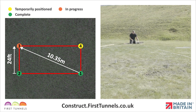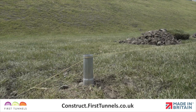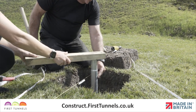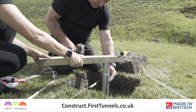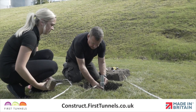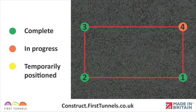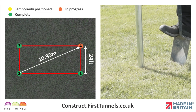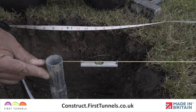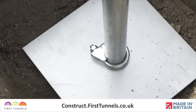If using anchor plates or concrete, excavate a hole and reposition the third corner foundation using the methods described earlier. To ensure the foundation tube is set level across the 24 foot width, tie a string line onto the second foundation tube close to the top. Adjust the height of the foundation tube to the correct level across the width. You may be required to return back some of the hole spoil to accommodate this. Once the third foundation is the correct height and position, secure it into the ground using anchor plates or concrete. Excavate a hole and reposition the fourth corner foundation using the methods described earlier. Tie a string line from the first corner foundation and pull it taut across the width to ensure the fourth foundation is level with the first foundation, and secure it into the ground.